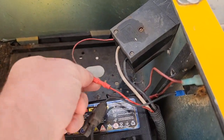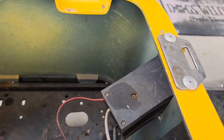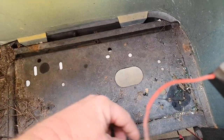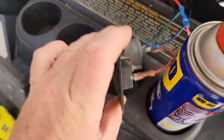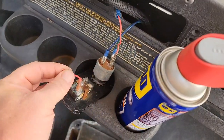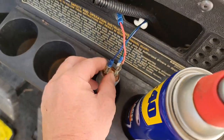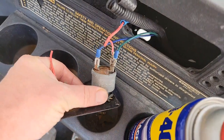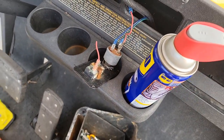I've checked most of the terminals and I'm going to have to clean them up, but it didn't actually burn them. There were some wires that were fried and I pretty much fixed them and put butt connectors on them. The ignition switch has a little meter to tell you the voltage — those terminals were just fried off. I jumped it straight to the actual ignition switch and checked it with an ohm meter — it's working correctly.